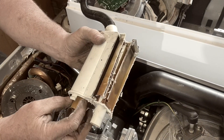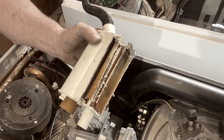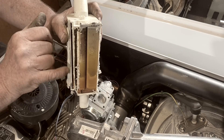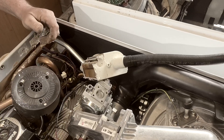As you can see, that was the bit that I took off to clean. And this is where the pipe comes out and goes to a drain. That's how it causes a siphon — fills up to a certain level and it discharges the whole thing at once down there and then comes out the other side.